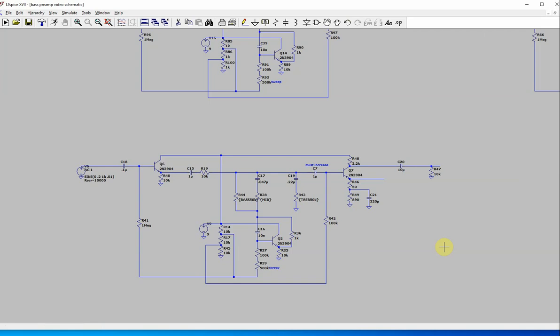But really, you can tell that with the mid control, the whole way the bass sounds when sweeping the mid can be made to sound a lot different. If you built this too, you could also put another capacitor here with a little switch so that you could extend the band, or have high parametric and low parametric. That would be a neat improvement, and it would be kind of minimal. But for three transistors and making a pair, I think it turned out okay. Definitely acceptable. I mean, I would use it.